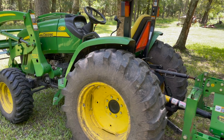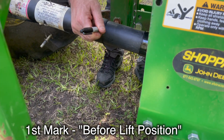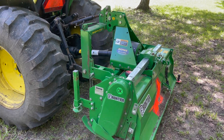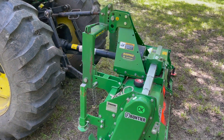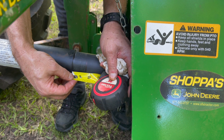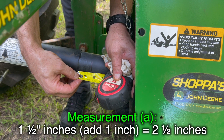Now let's use those same measurements on this tiller. This is a great way to measure every implement you have to verify if adjustments are needed to any of the drivelines you will be using with the PTO-Link system. Measurement A: we need to make our two marks on the inner driveline shield, one before the hydraulic lift and one after, to measure the maximum slide distance. Lower the implement back to the ground and measure the distance between the two marks on the inner shield. In this example, the implement slides in a total of 1.5 inches. Now add 1 inch to that measurement for extra safety, which makes Measurement A on this tiller 2.5 inches.